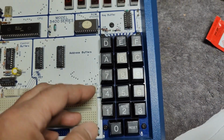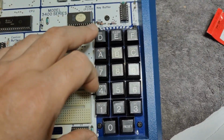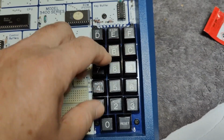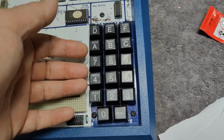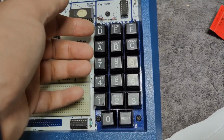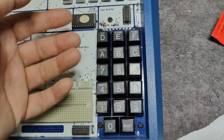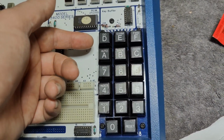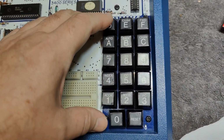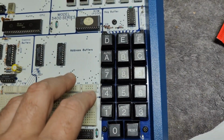So that means once you go to the right address, you select the right bits, and then you will get whatever you push directly into the data bus. So of course it's not going to work if you write to those addresses, but you of course need to read. And then as long as you're just there at the right address, you are going to get the data. So they really tried to make it as simple as absolutely possible.